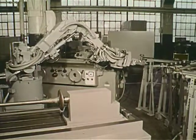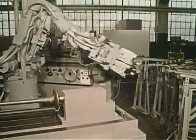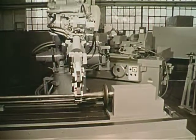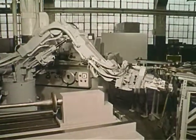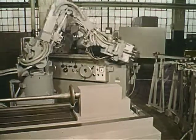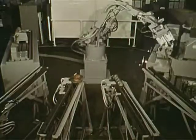Over the years, many developments have led the way to a high degree of automation in the metalworking industries. Transfer machines, NC machinery, tool changers have all played an important role in increasing the productivity of these operations. However, until now, all attempts to automate the part loading and unloading operations have required special machinery, heavily tied to the specific machine and part to be handled. As is demonstrated, the 6CH arm completely eliminates these restrictions.